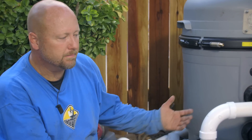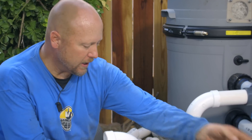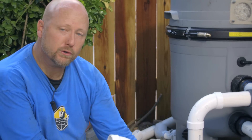We have the Koi pond filtration system basically all plumbed. We don't have the aero done yet, but I want to tie all these lines in - from the suctions to the returns, all these elbows that I have hanging - to make their way back underneath grade. They're not glued yet, but I'm going to go ahead and start to run my verticals.